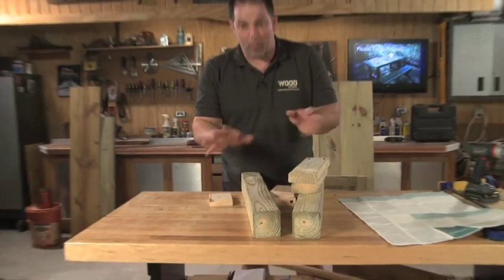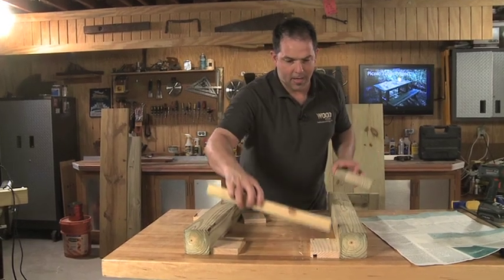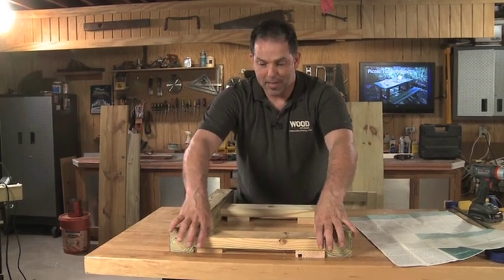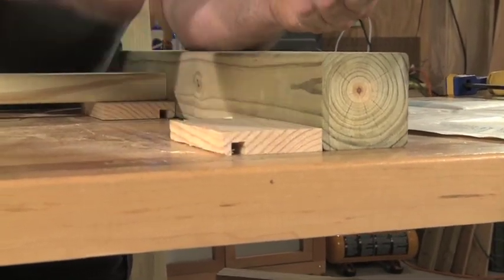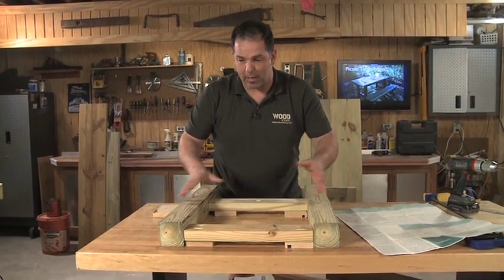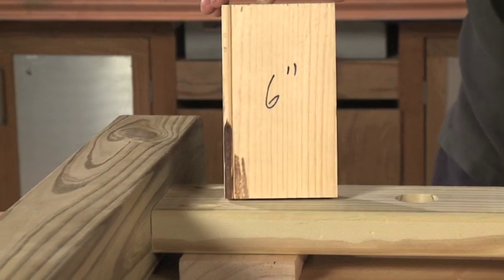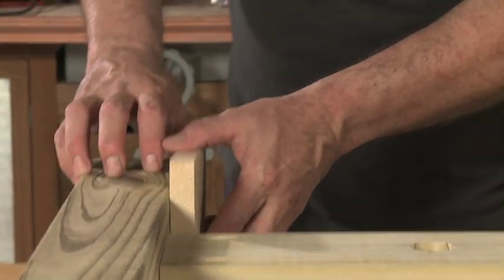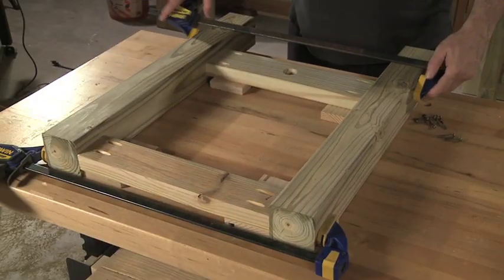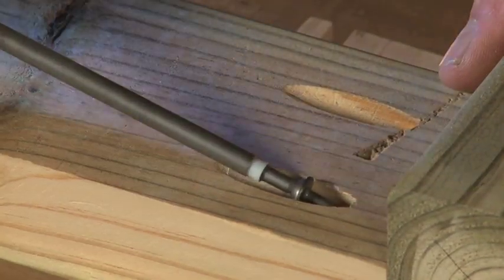I know it looks like a big pile of wood right now, but watch as it is magically transformed into one of the ends of our picnic table. These little extra blocks of wood are just spacers. I put them underneath both the apron at the top and the stretcher at the bottom so that they're not flush with either side of the leg. Our six-inch block right here is so we don't have to measure each time — I'm putting the stretcher six inches from the bottom of each leg. Use clamps to hold each end assembly together and then install pocket hole screws into each of the eight holes you drilled.